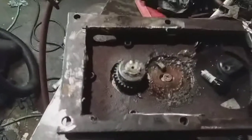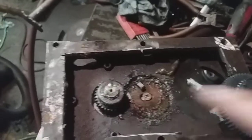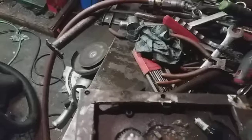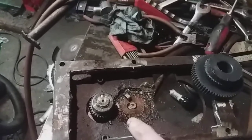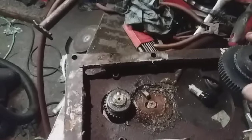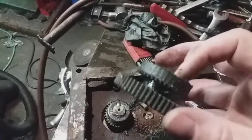So I got new gears coming in. I'm back over here. I'm going to replace these two gears that go here with the same size, 35 teeth, 35 teeth, so it'll be a 1-to-1 ratio. When the person put that project together, they've got some pictures on G0704.com under projects. It shows a gear swap of some sort. That's basically what I did, and I didn't remember that I had seen that, and I ended up just doing it. If I had remembered, I might have done 1-to-1 to start with, so I just ended up getting some more gears.